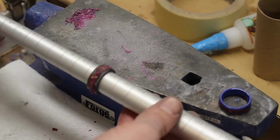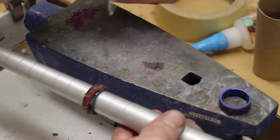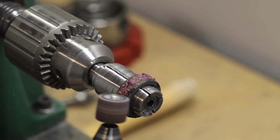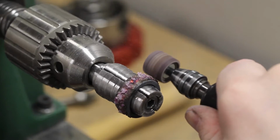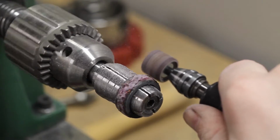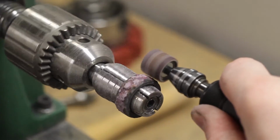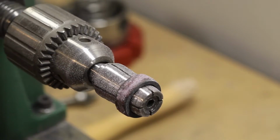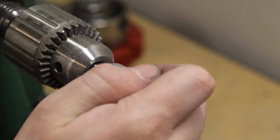And then once the couple of drops dry, bring it to the lathe, take the Dremel and just smooth it out so we don't have a lopsided ring. So I'm just getting it all pretty even before we take the sandpaper and turn it on. Makes it easier to sand and swell in the end. From there we'll take, I think 80 or 120 will both do the trick, and we'll just sand that down. Sand the inlay until it is even with the carbon fiber.